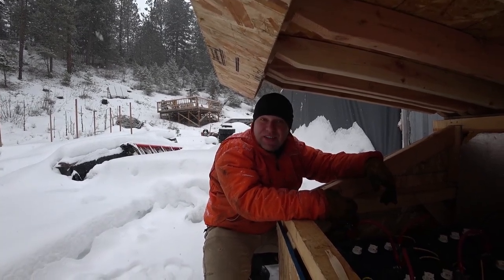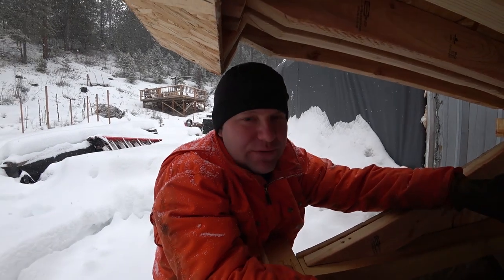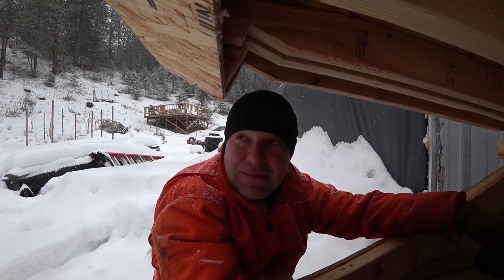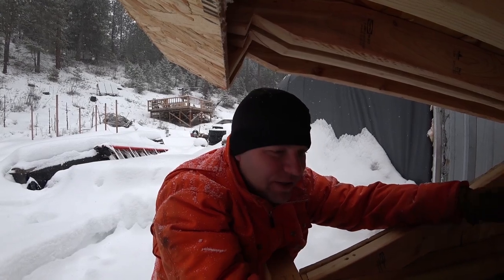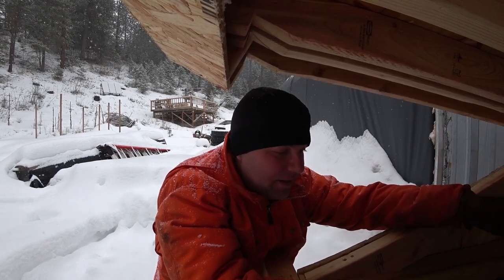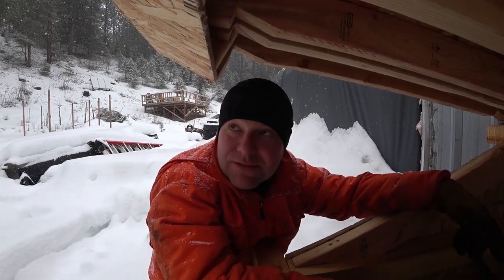It feels like I'm running in circles chasing two batteries. I had this desire to isolate them and figure them out, but at midnight last night we tried to move the inverter cables over to the six other batteries and the cable wasn't long enough — so we just had to tie everything together. I feel like we're doing it wrong. We need a massive battery box that's easy to get to, just the right amount of cable, and batteries that aren't so heavy. What we're going to do is try to charge the entire bank with the generator all day, get them up to a full saturation charge, run through an equalize, and then maybe check individual voltages and possibly disconnect those two batteries to let them sit with no load.